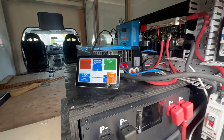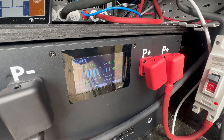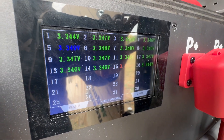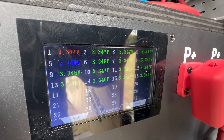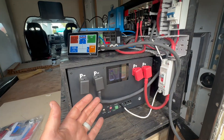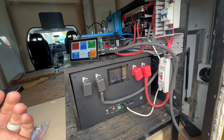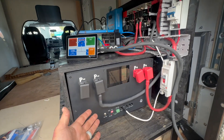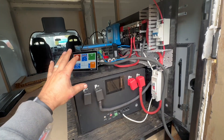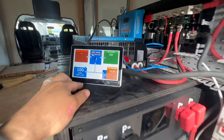Something I want to mention, especially when you're first setting up your system: you may see your battery say 100%, like this one does. This is showing 100%, but it's still not full. A big way you can tell is just look at the cell voltages. You want to see 3.5-something — ideally 3.6 or 3.55 — that's how you know the battery's full. For a 12-volt battery you're looking for over 14 volts; 24-volt, something over 28; and for a 48-volt battery, we're looking for something closer to 56 volts. As you can see here, we're at 53 still, so we potentially have a long way to go.